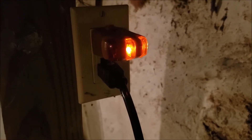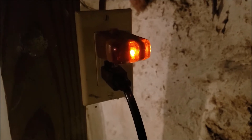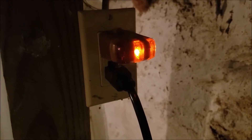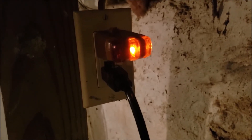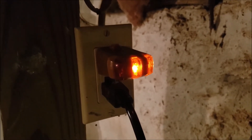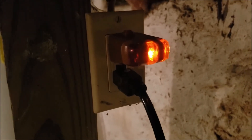Which one would you rather have in your basement? It wasn't the flood water that killed the person that came down to see why there was flood water in the basement — it was a sump pump that shorted out when they grabbed hold of it. Sorry guys, you lose this one. GFIs on sump pumps with an alarm.